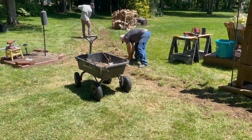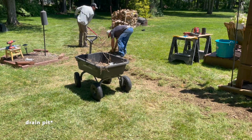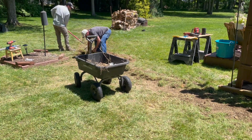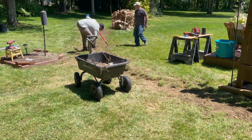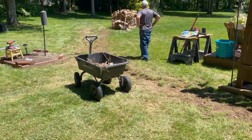We got lots of slope, and then the pipe goes out into the drain pipe. And actually, after we finished and the glue cured, he did run the sump pump, and all the water went down the pipe, and I didn't see any leaks or anything, so everything looks good.